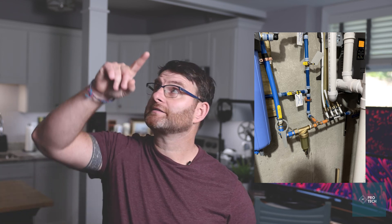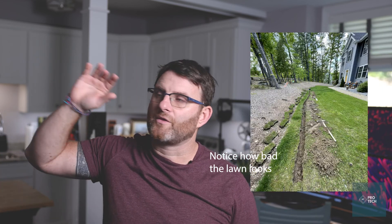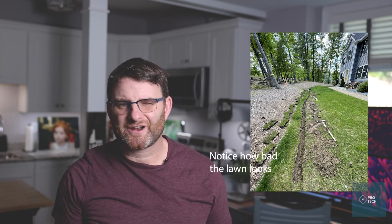I did the installation myself. Very easy with some PEX. I used a manifold, tapped off my home water supply, ran one-inch PEX across to the front, which went to a three-quarter backflow valve. I researched all this — I am not a plumber — but my plumber friend said I did it correctly. So what I'm telling you is how I did it, overall approved by a plumber. Then out to the middle of my lawn where I put a sprinkler head, teed it off, one went to one side of the lawn and one went to the side of my house. Pretty straightforward process.